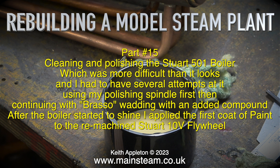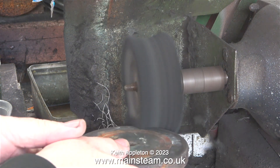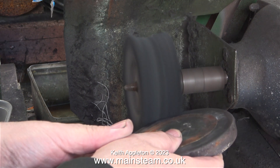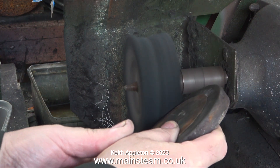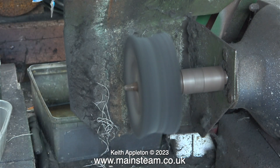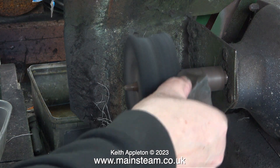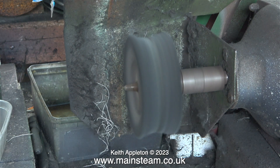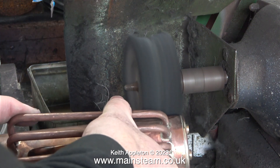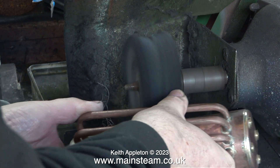Here I am in the outer part of the workshop at my polishing spindle. You may be wondering why I'm using an old grinding wheel on the polishing buffer. What the grinding wheel does is true up the polishing buffer, then you can apply some more compound to it and it polishes a lot better. This tip was given to me by a friend of mine who used to work in the electroplating industry.